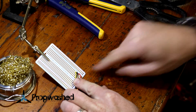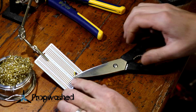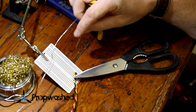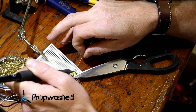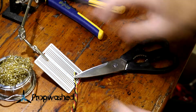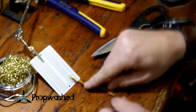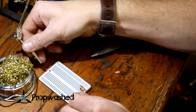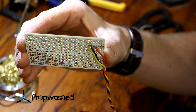Sometimes you'll have a wire where the length is just not quite right. I like to just have a little piece of weight — the scissors will do fine. Hold the wire down, it's like a fourth hand, and you go in and solder down. This isn't a beautiful job just because it's tilted to the side and you can't get access to these holes, but if you look at the joints themselves, it's very nice.